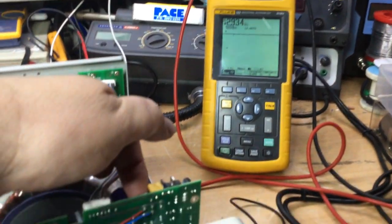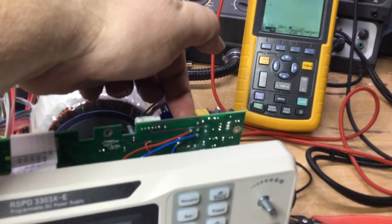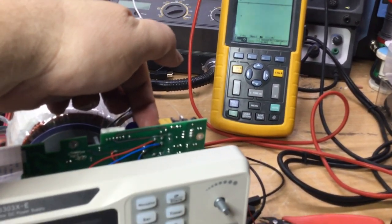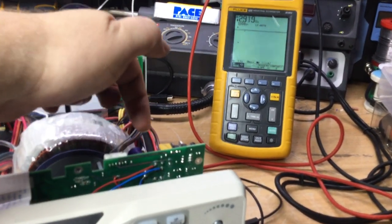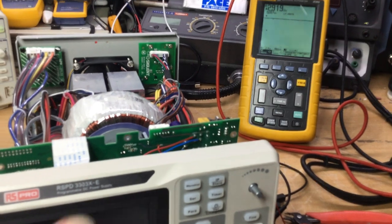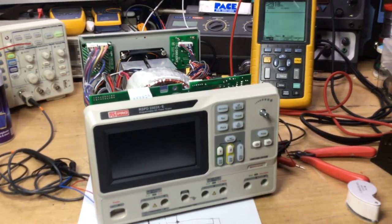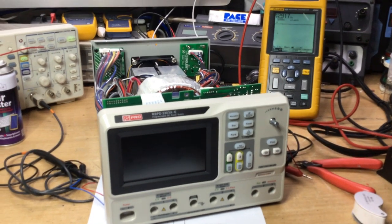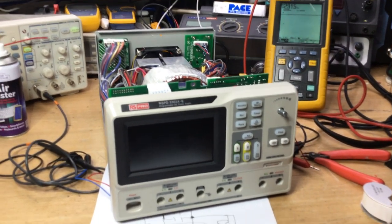So, to 3 volts, which I find quite strange. And yet the bridge rectifier, to touch it, is cold. It's not even warm. So if that was a current consumption issue, i.e. the output of the bridge rec was shorted, that'd be getting stinking hot. To pop the fuse as well, there'd be definitely noticeable signs that there was excessive current consumption taking place. So let's get to the stage now, replace the bridge rectifier, and then take it from there.